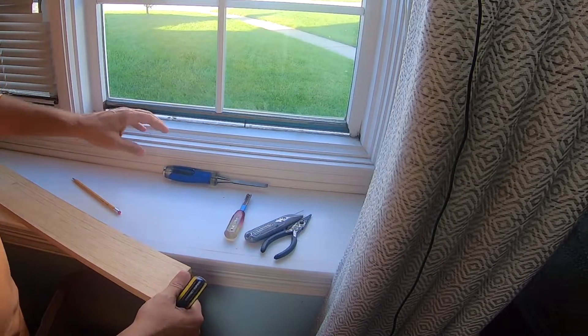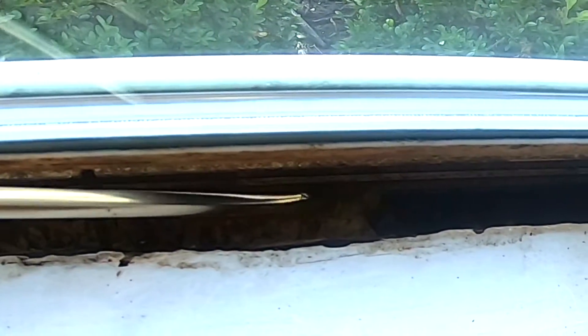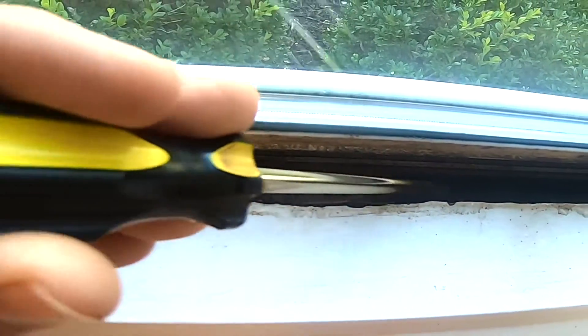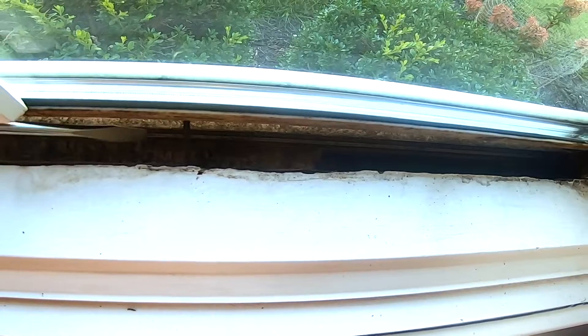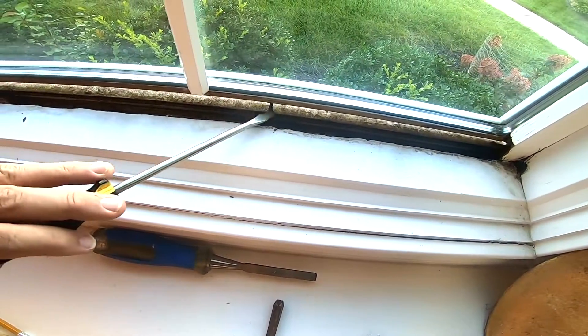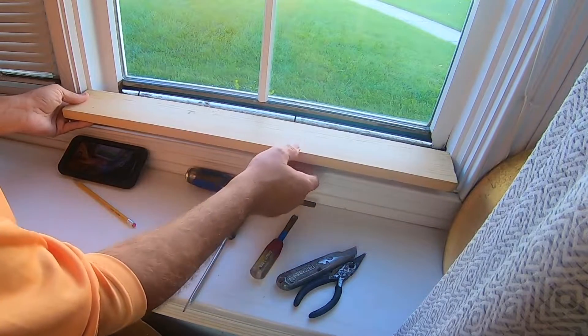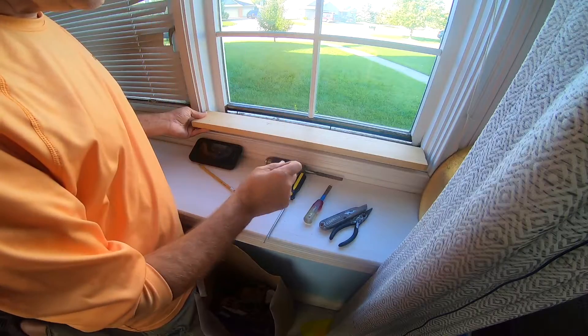What I'm going to do is from the inside try to build up the wood that's rotted away. What I have in the very bottom layer right here is foam — that's the foam they put around the window to seal it tight from air. So this area should be foam, and on top of the foam should be wood. I need a skinny board to sit on top of this foam, and then another piece on top of that. I'll use cedar because cedar doesn't rot, so that's what I want to use to fill this in for a more long-lasting repair.